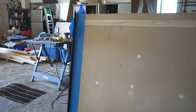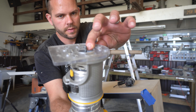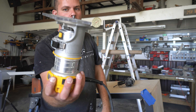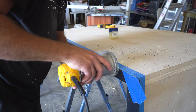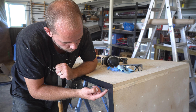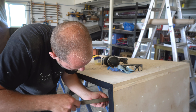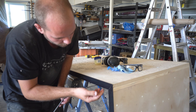We got these all glued in place and we have a bit of overhang on the top and bottom — that's what you want. The next step is to get your router with a flush trim bit. You want just a little bit sticking out so you don't run the risk of scoring. Then you run counter-clockwise around your piece to get rid of all the excess material. Because we're using a router bit it's going to leave a radius in the corner, so to get rid of the radius just take a file and slowly go in at an angle — you can clean both sides up and then you have a nice 90-degree corner.